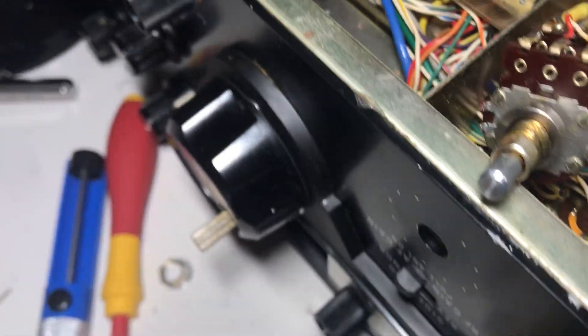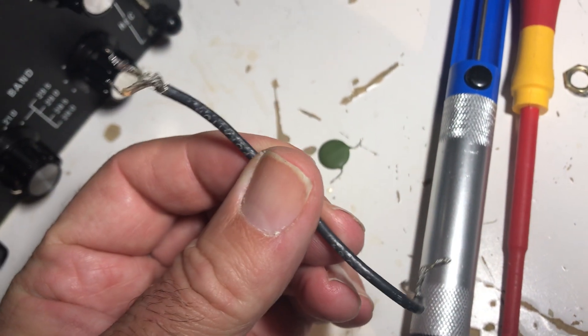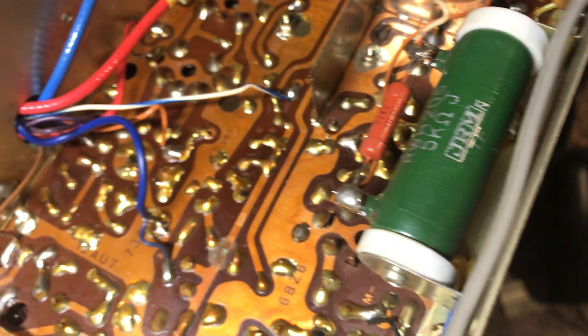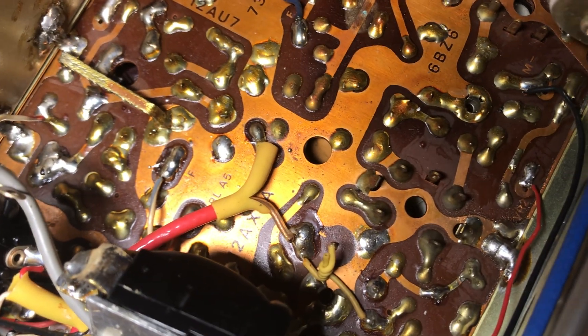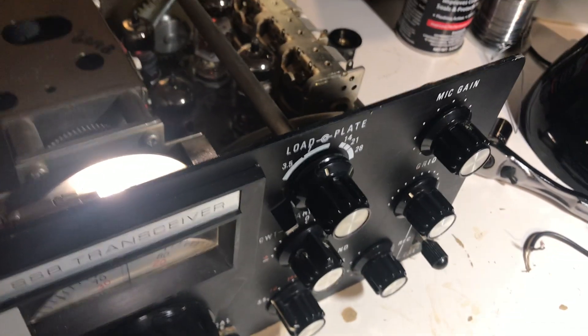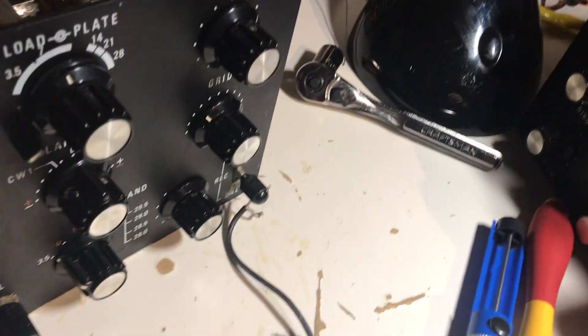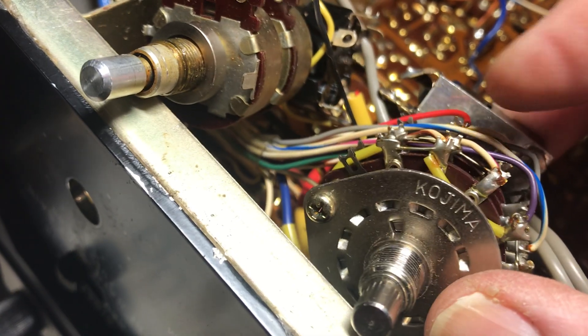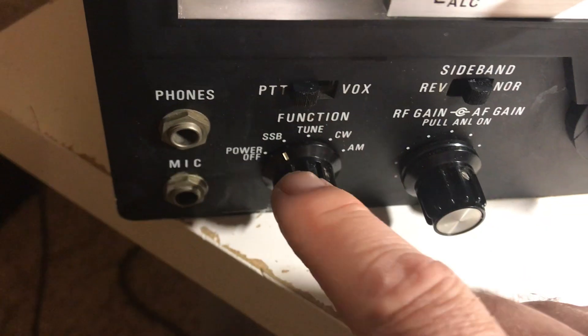The previous owner had a spare piece of coax coming off the switch and all the wiring was scrambled up. Luckily I had this other radio here that was pretty much untouched and unmolested, so I looked at the wiring on its IF board and set this radio back to match that configuration. I ended up with one wire going nowhere that I couldn't figure out. So I took the switch all apart, removed that wire, and compared it wire for wire against the working radio, which took some time.